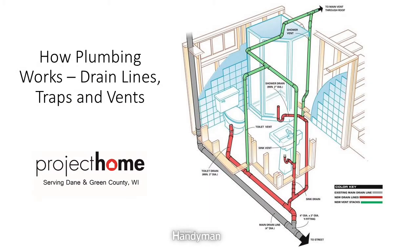Our next page is how the plumbing works. The gray pipe is the main under the floor, and it also goes out through the roof and to the street. The red is the actual drain — it goes to the toilet, the lav, and up to the shower. Some minimum sizes to remember: the minimum size for a toilet is three inch. The minimum size for the lav, if you're doing a bathroom group, is two inch up to the T. The minimum size for a shower is two inch all the way up to the drain.